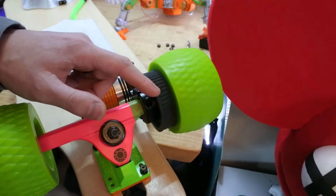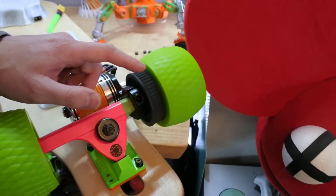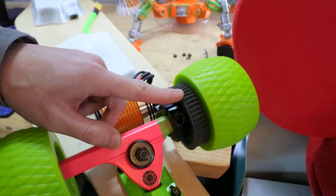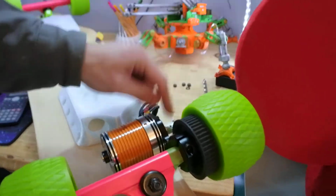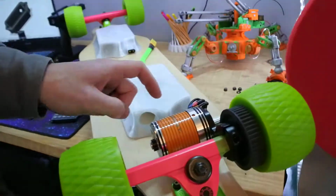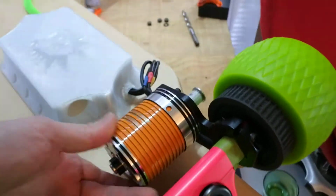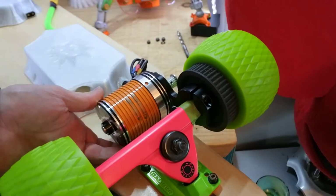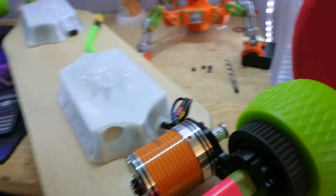Drive gear at the moment is a 3D printed one out of PETG carbon fibre filament. I forget which brand, but I'm missing the belt. And this gear here is the wrong pitch. I bought the wrong pitch, so I'm waiting for a belt and the right pitch gear. For motor, I've got a Turnigy D5035 125 kV motor, so a low kV but high voltage setup.